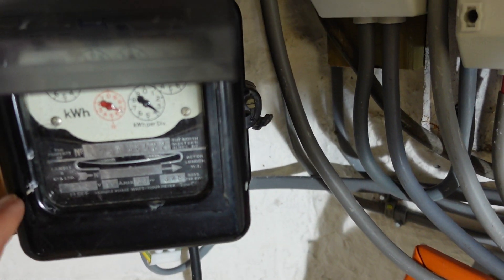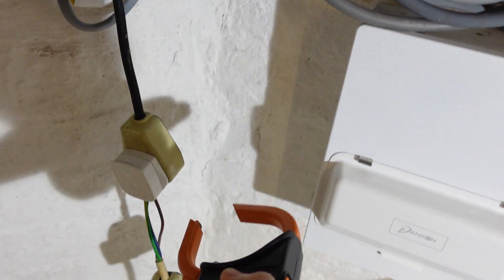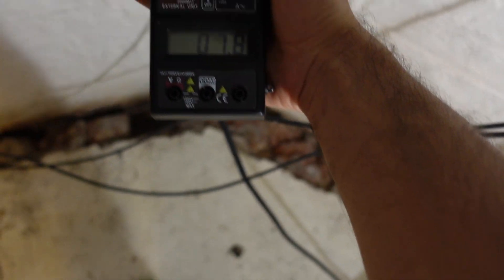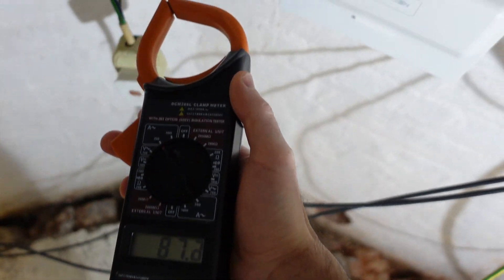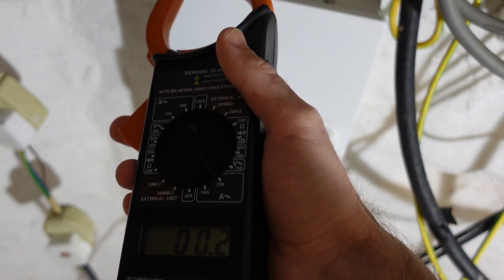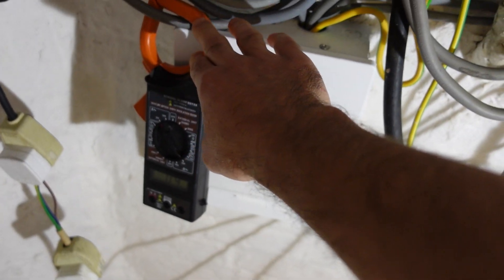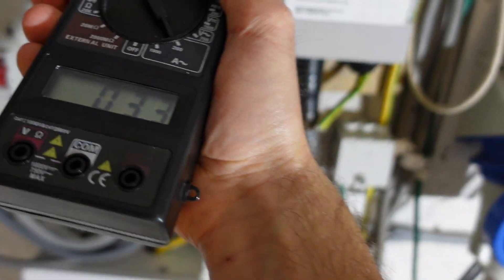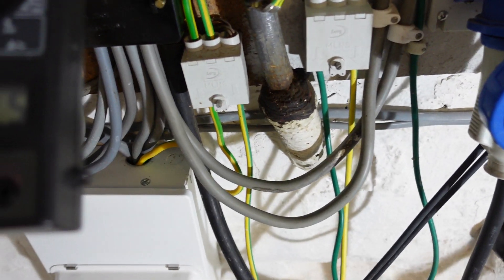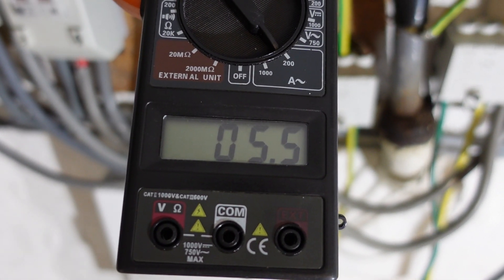Now I've got this meter spinning and unfortunately it doesn't give me a current rating. Let's see what's going into the hot water tank at the moment — nearly 8 amps. The missing link there is about 3 amps or whatever it was before on this cable. I can put it on the main incomer to the house, and once it settles down it should go to the same reading. Other than what's going on in the house, it's coming up around 5 amps.